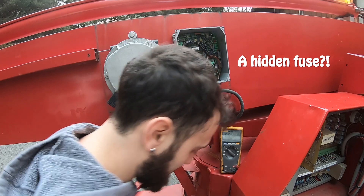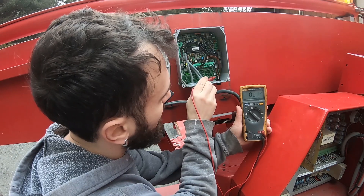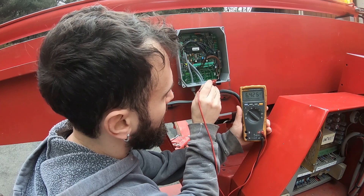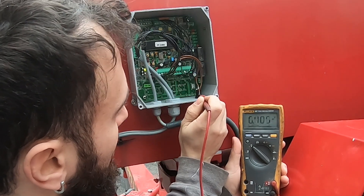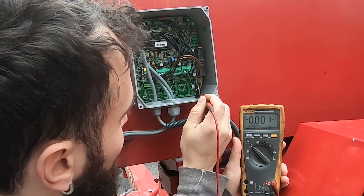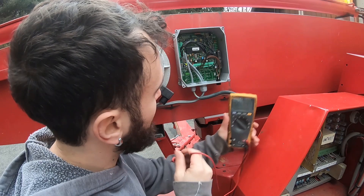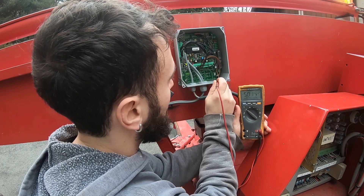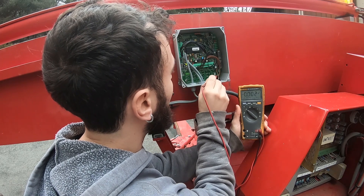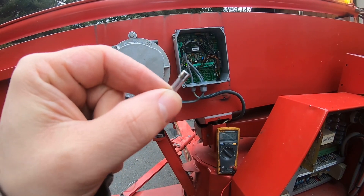Let's check this fuse — maybe that could be it. I can test the fuse by looking at energy on each side of it. I have it on one side but I'm losing a lot on the other side — it's almost like it's high resistance. I just took it off charge, so we're seeing slightly different voltages: full bus is 26.5 volts, but on the other side only 6 volts. I'm losing it across the fuse. This is a 1.6-amp fuse — let's see if it's good.